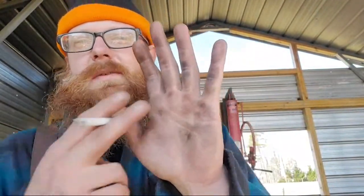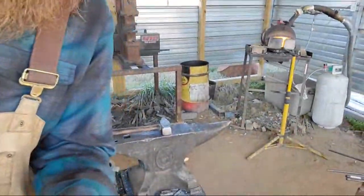I personally wouldn't put any kind of pizzazz on tong rings because they're made for comfort, smooth, streamlined, you know. All those high spots become hot spots in your palm, because there's less surface area of your palm touching the tong ring with a lot of undulations in the twist. So it wouldn't disperse that friction over a larger space. It would cause hot spots in the small spaces it's confined to. That's the way I would think about it, honestly.